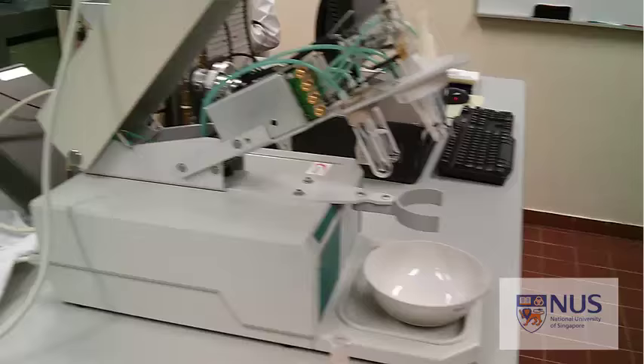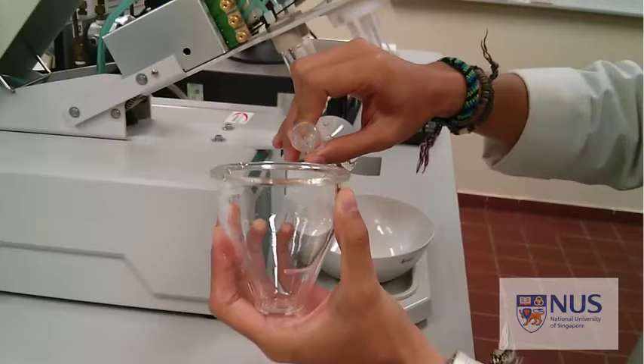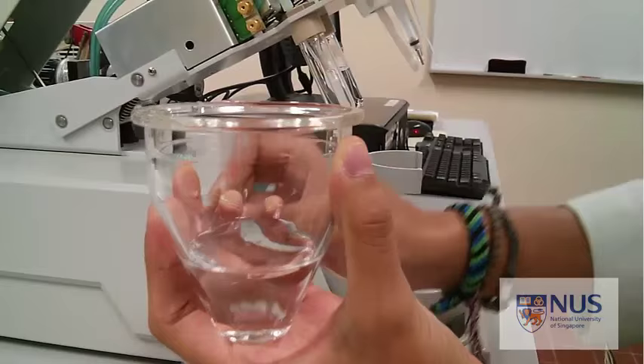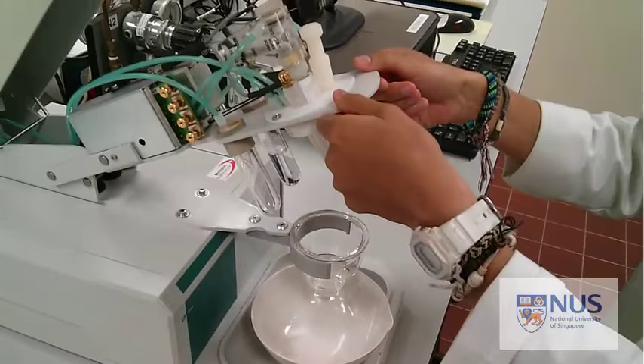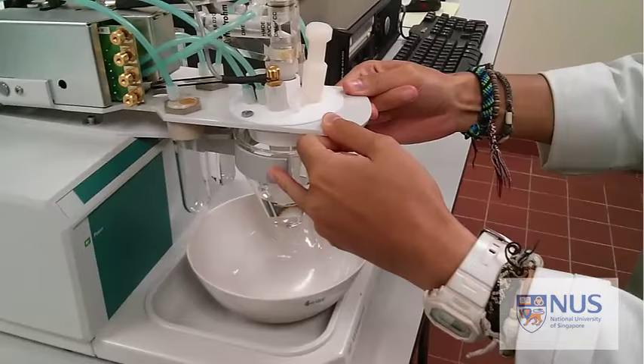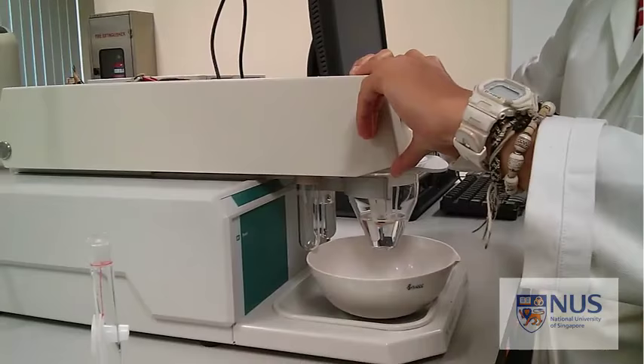Just put in a little bit to swirl around the bottom, make sure it's clean and that you're not going to dilute it by any leftover water in there. Then you put your sample in - there is a marker on the vessel and you know about where you need to fill your sample, just above the marker is fine as long as all the electrodes are submerged in the solution. Put this back into the holder carefully and once again very carefully bring this down gently into the solution. Use both hands when you lift this up, take the clip up, and then you can pop that down as well.